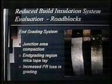I'll talk a little bit about the roadblocks. The roadblocks from the existing system to achieving the reduced build were primarily in the end grading region, and the reasons for that were that the insulation compaction in this region is a little poorer than it is in the slot portion because it sits outside of the normal shape aids. The taping around the bend portion of the stator bar is also a little poorer than it is in the slot portion, so it affects the performance of the end grading region.